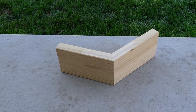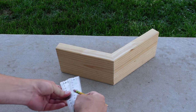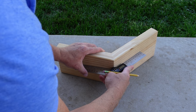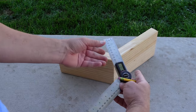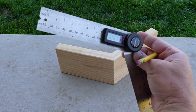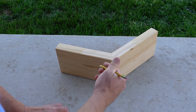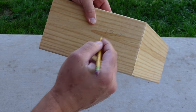I need everyone to use their imagination right here. This is a wall you're trying to put trim on. You want to come and measure that wall. I'll take out my angle finder and sit it on that wall. It's right at 120. So 120 is what my angle finder says. Now let's get over to the miter saw.